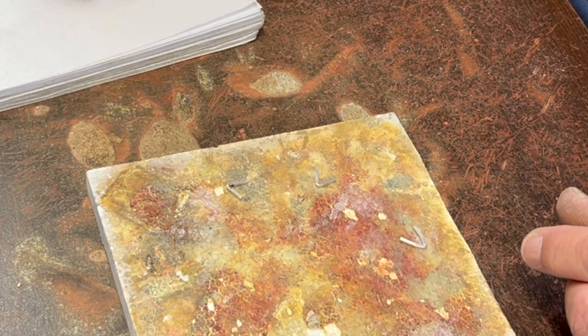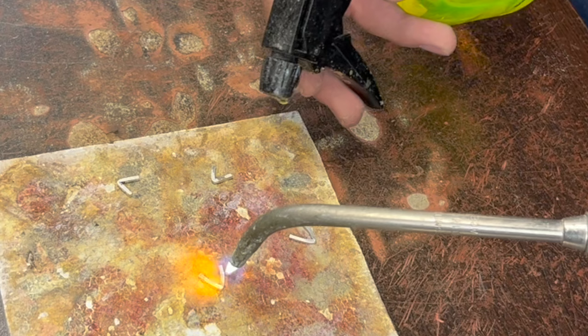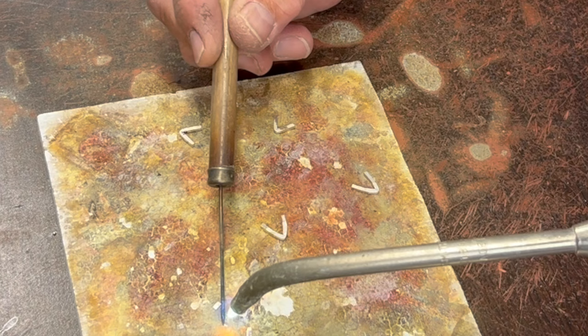And I'm just going to cut some little tiny pieces of hard silver solder. If you've never been to my channel, I use primarily hard silver solder, and I use a liquid flux called My-T-Flux. I do a lot of pick soldering too. If you're interested in pick soldering, I'll put a link up there for you. I just picked it up on the end of the pick there.